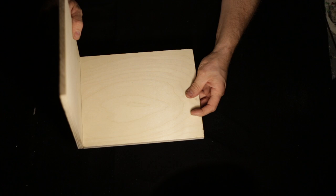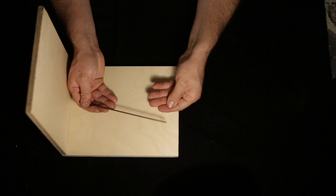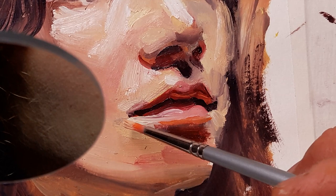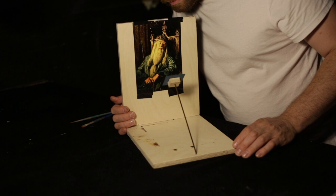As an optional extra I might also glue the wire into place. Then all I need to think about is the mirror on the end of this boom arm. There are some core principles: the mirror needs to be at exactly 45 degrees to our source plane, and ideally the same distance from both planes. It's a beautifully simple idea — we've got Tim Jennison to thank for it — but actually arranging a contraption to do this can be very fiddly and problematic.